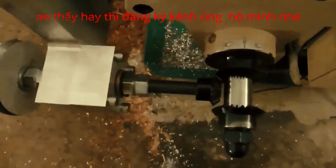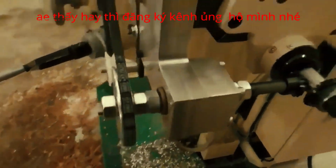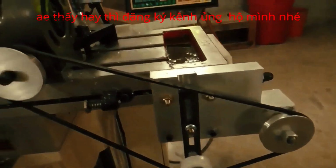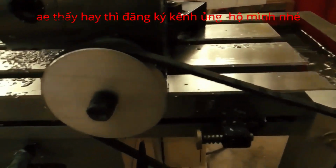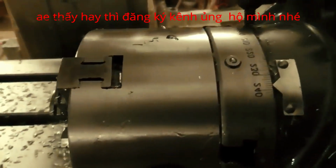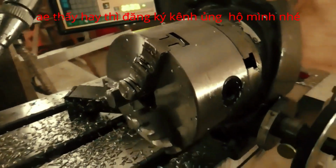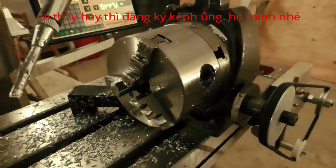Now, when that shaft rotates, it turns a pulley, and I've got another pulley mounted in place of the handle on a rotary table to which I've mounted that little lathe chuck. This gives me the coupling that I need between the longitudinal axis of the mill and the rotary table so that I can very easily machine helical grooves in cylindrical workpieces.